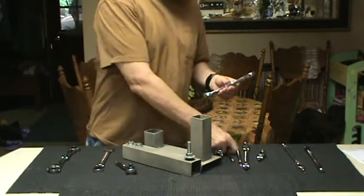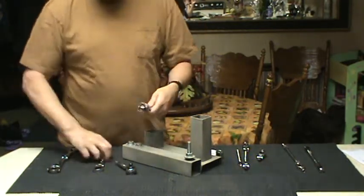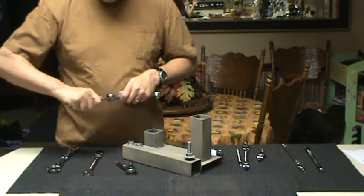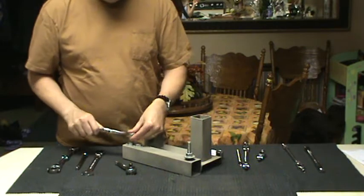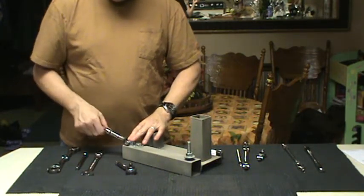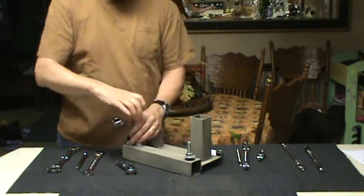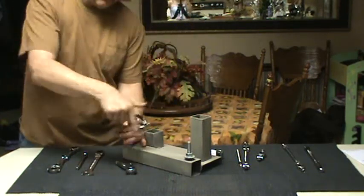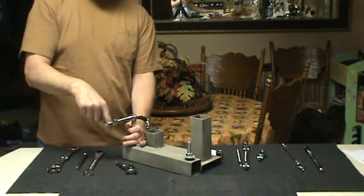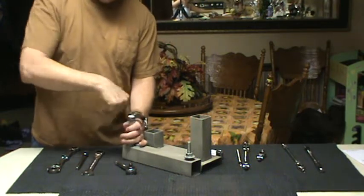I can also add length to this wrench for really tight bolts. You can't lengthen a regular wrench. What you have is what you have. One of the other main features is when you break a bolt loose or tighten it up, as soon as you do, you flip it up and you can ratchet off very quickly. When it's very loose, you spin it off, just like that. Spin it on, spin it off very quickly. You can even stick your finger in the opposite wrench head if it's large enough. If it isn't, you can just push it either way.